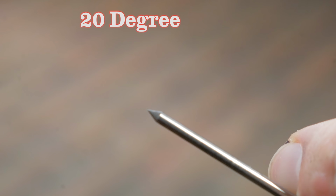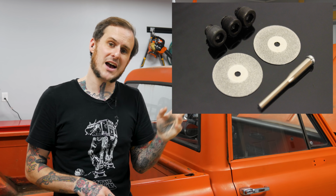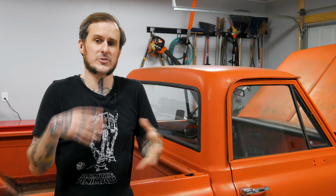Now in the Delrin version, it has steel insert guides to guide the tungsten to the grinding wheel. You get 3 of the guides with the Delrin tool. They come in 1/16, 3/32, and 1/8 inch size. You can get a 040 guide if you want, but you have to choose to replace one of the guides that you're getting. So maybe you want to get rid of the 1/8 inch one and get the 040 so you have the smaller stuff for the smaller jobs.